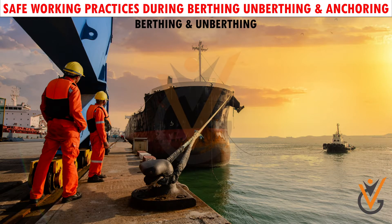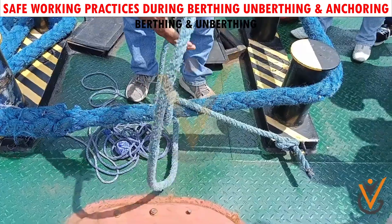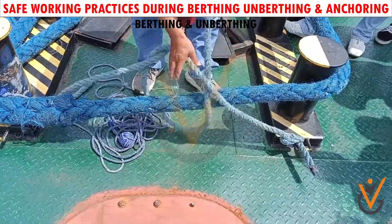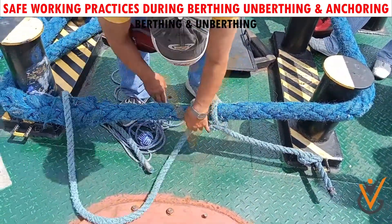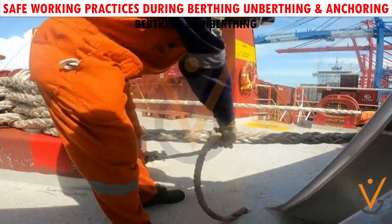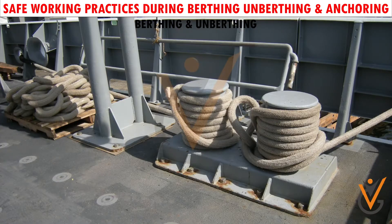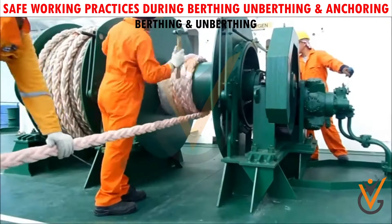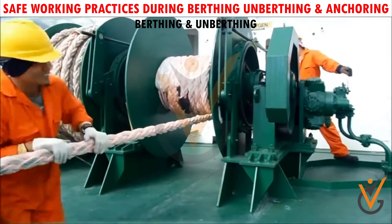De-icing compounds should be sprinkled on deck to melt the ice. Keep well clear of lines when they are being heaved up. Do not stand in the vicinity of the line or your leg will get entangled with the line when it is running out. While transferring the lines from the drum to the stopper or double stopper, ensure that the line will be tight on the bollard. If there are chances of the stopper parting, let go the stopper. Do not keep the tug line on the drum; always keep it on the bollard. Mooring lines can be kept on the drum, finishing off with a half hitch to prevent it from slipping.